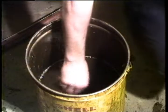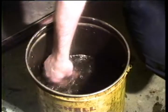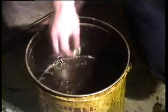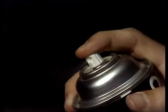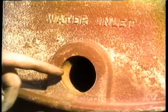When checking the oil, you should also remove and clean the breather if you have one on your control box. Clean it with kerosene and dry it, or follow with an electrical cleaning solution. Check the air gap at least once a month. Cooling water should be checked weekly. Look in the manual for the specifications on your brake model.